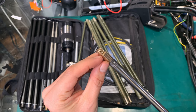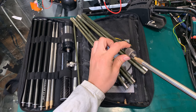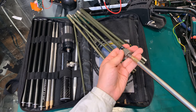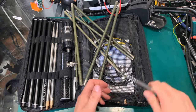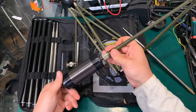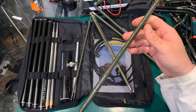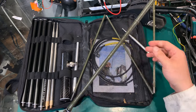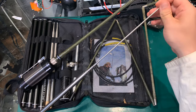So I checked the thread on this antenna — it's M10, metric 10 — and it happens to be exactly the same as on the ANT 129 antenna from the TRC 552. As you can see, that's exactly the same thread. So you have the ability to screw it onto the matching unit, and you've got yourself a half-military, half-civilian antenna. Of course you were using this part for fine tuning.